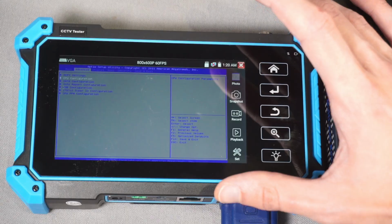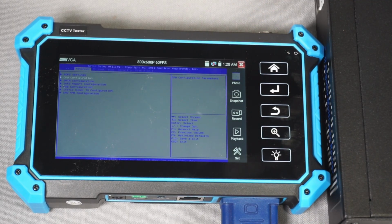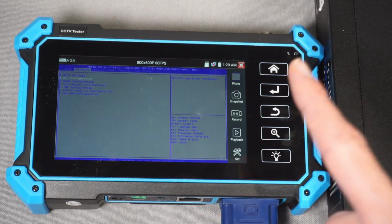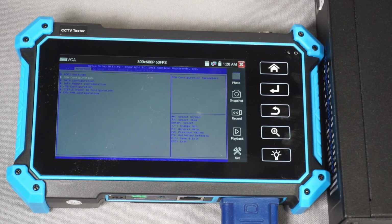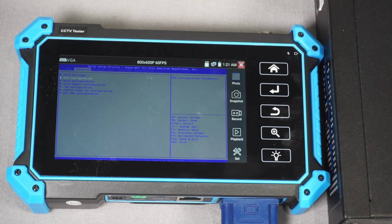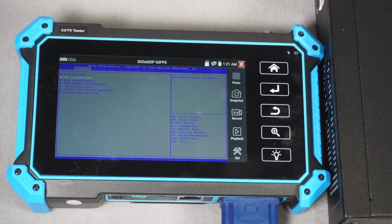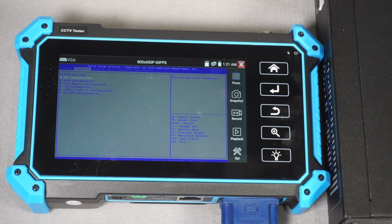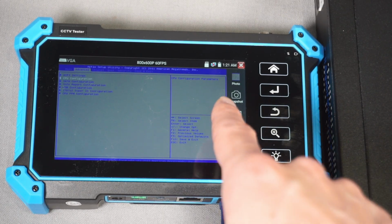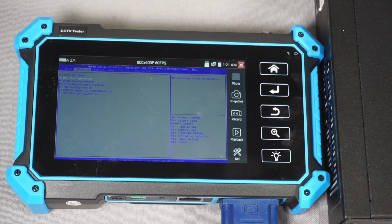The only issue I've found, and it's a very understandable issue, is that if you're recording and the screen resolution changes, it'll stop recording. Now that's only really an issue if you're wanting to record a boot sequence of a machine, because with this machine in particular, as it's booting up, the screen resolution changes around. It starts off really low and then the bootloader comes in and that's a different resolution, and the OS boots and then changes resolution halfway through the boot process. And if it's doing that, it will periodically stop the recording. But yeah, that's the only quirk I found.